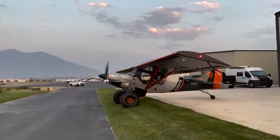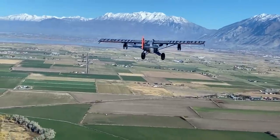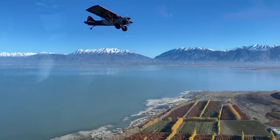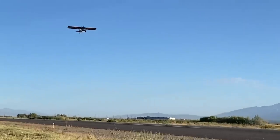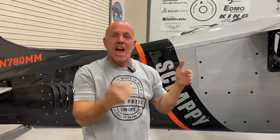Scrappy's got a big engine, and fortunately when I was playing with the numbers, Scrappy was actually a little bit aft CG. In all the design and work you do the best you can — Scrappy was great. You could fly it. It flew right in CG limits all the time, every flight I went on, but it didn't quite have the baggage capacity that Scrappy's payload is capable of. So I'm going to switch it up a little bit while I move the engine forward to get room for the turbos. Instead of having CG more neutral, I'm going to put it so if there's just one person flying in the front seat, I'm right at the forward limit. That way when I add a big heavy person in the back, lots of luggage in the back bay and the belly bay, and tank the hundred gallons plus the fuel this thing has, I still have a lot of leftover room and I'm not on the aft side.